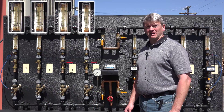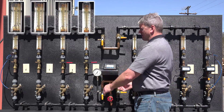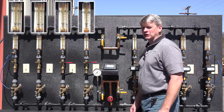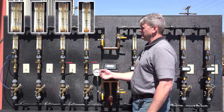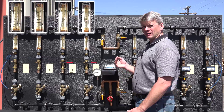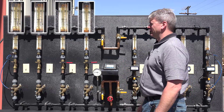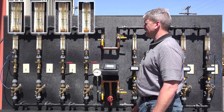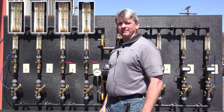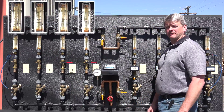Now we're going to look at the automatic balance side. Same condition at system startup — the pump is turned on for the first time. As the pump spools up, pressure increases in the system, and once the automatic balance valves reach their required differential pressure, they'll deliver the set design flow. As you can see, everything comes in at 2 GPM. No multiple balancing attempts — it comes in automatically.